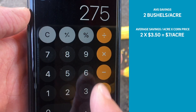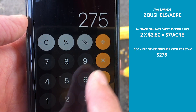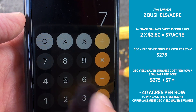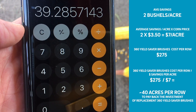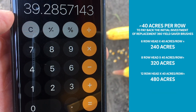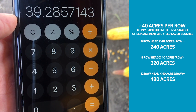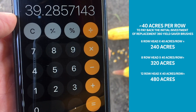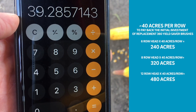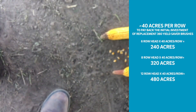In the harvest seasons to follow, the only thing we're doing is replacing the brush kits as opposed to replacing the whole unit. We'll take an average brush price of $275 a row and divide that by our $7 — that's the first 40 acres to pay for the brush kits. So on a six-row head, about 240 acres. Eight-row, 320. Twelve-row is going to take about 480 acres to cover the cost of the brush. Everything that those heads harvest after those acres is money in our pocket.